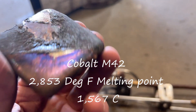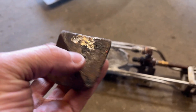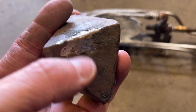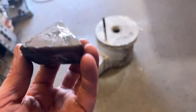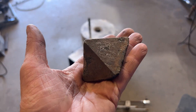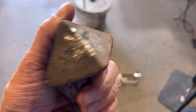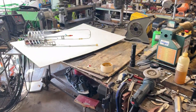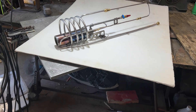This burner right here can produce ingots of high speed steel — this is high speed steel, and some stainless steel in there too, a little bit of stainless mix, we're just kind of testing it out. That's the goal today, and it cost I think $12 to melt the drill bits down with that burner, and we were at probably 180 kilowatts of power. So if we can get this burner to do it without oxygen, that would be phenomenal.